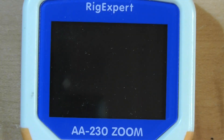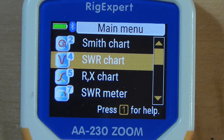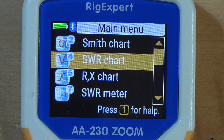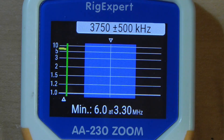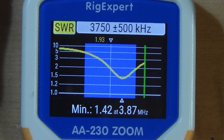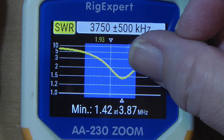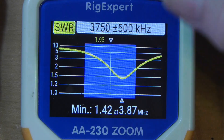We'll turn this on and it's going to do SWR charts. We need to select the band — we're going to do band 1, which is 80 meters — and do the SWR chart. Now we tell it to go. As we can see, it gets down to 1.5-to-1 in a portion of the 80-meter band, and in fact it goes all the way to the end of the band at 2-to-1. You could use your tuner across that entire upper half of the band. Note that we sacrifice the FT8 part of the band.